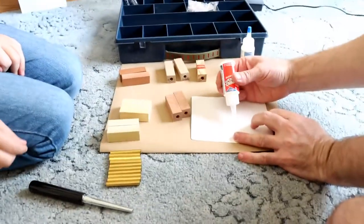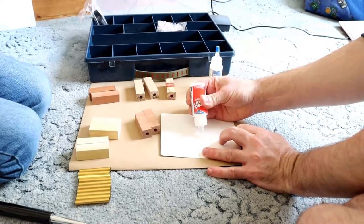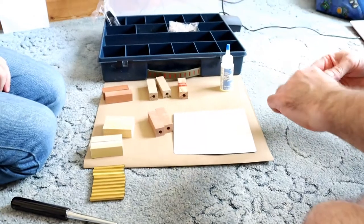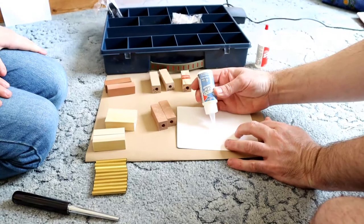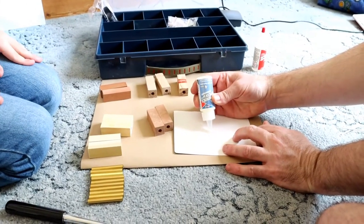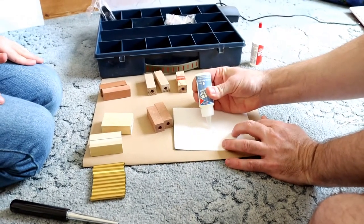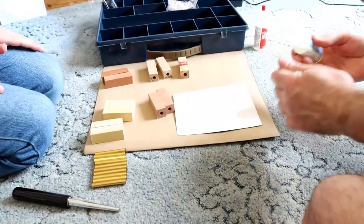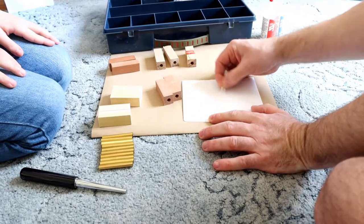So this epoxy resin should dry in 4 minutes. I like to get it a little longer. And you just need to mix equal parts of both the resins. I tend not to mix too much up. If you do, it ends up going everywhere. It's best just to be conservative with it. Also, it helps you if you have got two people because it does go off very quickly. That's our equal parts. Now let's mix it.